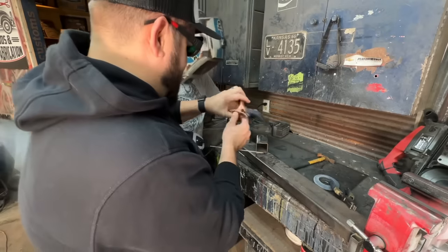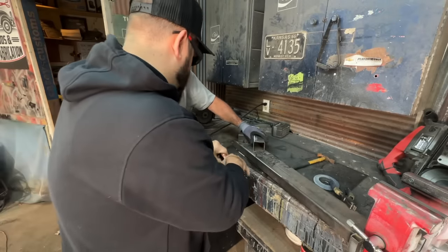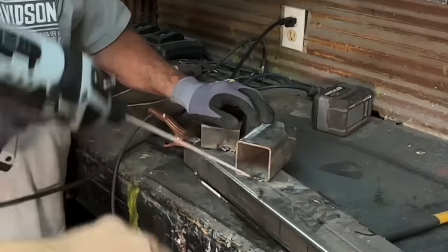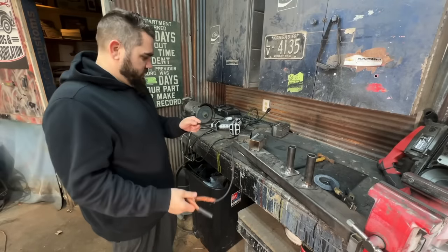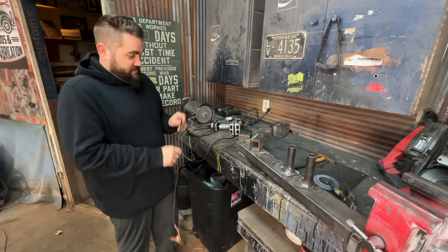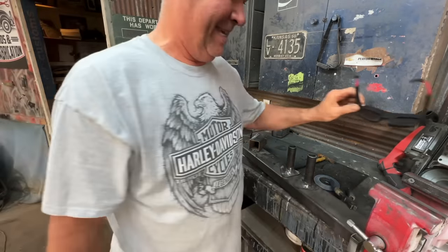Oh yeah, the ground's hot — the ground should not be that hot. Look how little of a piece of wire they used for that ground. You could upgrade that and do it a lot better. Is that better? These welding goggles are actually working. See, it's bouncing. You know what, I might do — since we're just having fun — I'm going to cut the ground way down, get a real wire, make it short. Then you could use these glasses and weld up that aluminum for me. We ain't doing that on camera because I'm not a good aluminum welder.